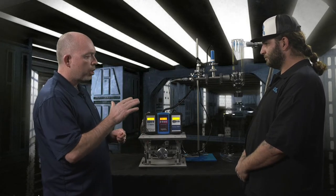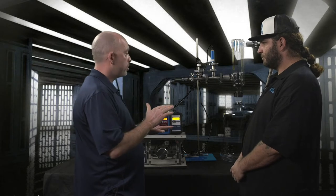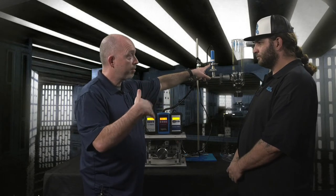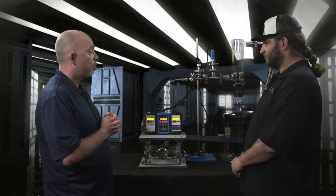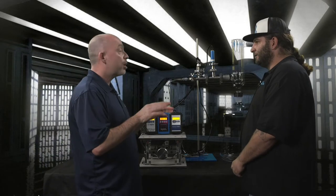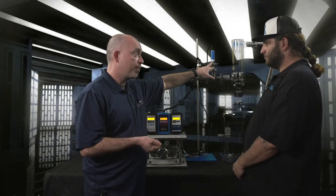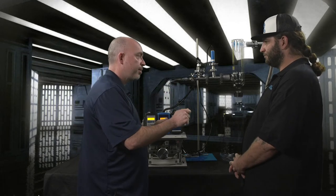Now, what if you're doing short path research and you want even better accuracy? Then we have something called a capacitance manometer. It's isolated, which means the electronics are separated from the media, so it doesn't matter if it's wet, dry, or contaminated. To clean it, you just rinse out the inside. The capacitance manometer is one percent of reading. This is a 10 torr capacitance manometer, so from 10 torr all the way down to about 100 microns, it's very accurate — narrow range, but really good accuracy in that range.